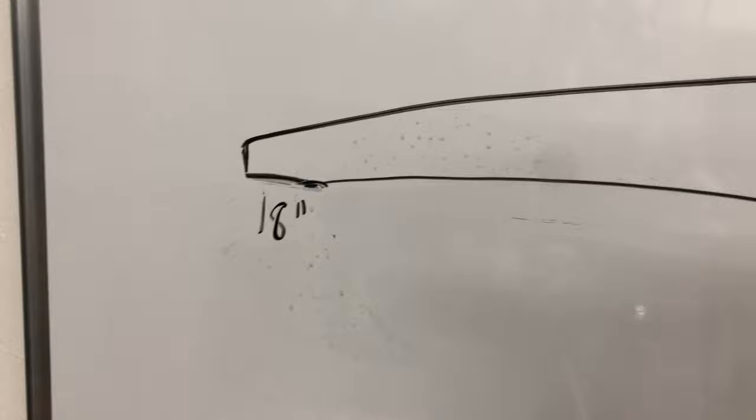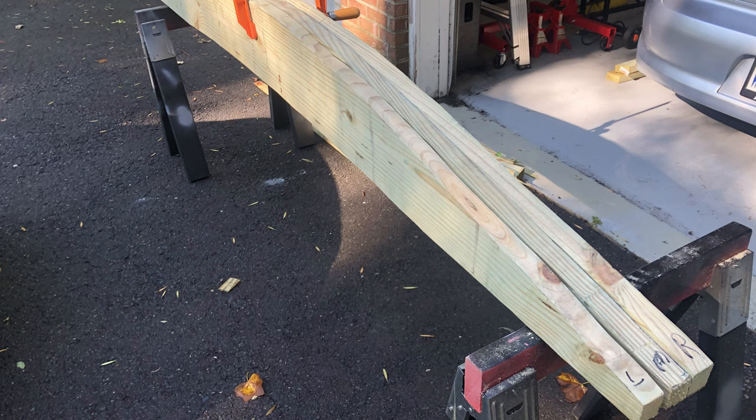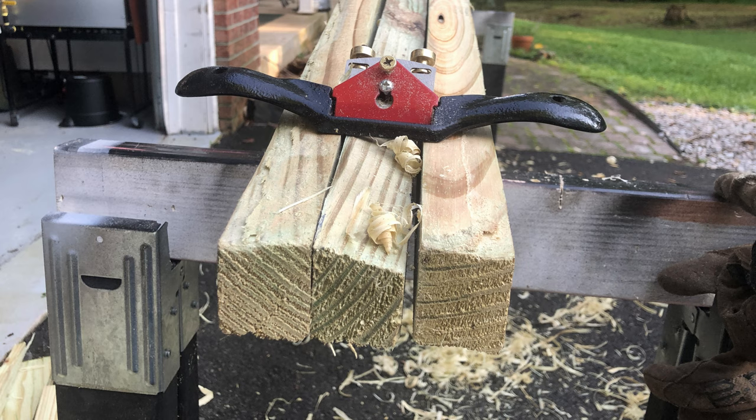I'm just giving you guys some rough numbers so that you can make a bridge that will fit your needs. You can make it wider, narrower, longer, or shorter, but in terms of weight capacity you're going to have to do a lot more research on that. For the outer or top curve, the best idea is to really use a circular saw — that seems to be the easiest way to do it. If you do a bottom curve like I did, you're going to have to use either a sawzall or a jigsaw. If you try to use a circular saw, it's just not going to cut properly in that area. Regardless, you really want to take your time cutting these curves — it saves a lot of hassle later on. If you have even the slightest slip-up, you're going to be doing a lot of cleanup.